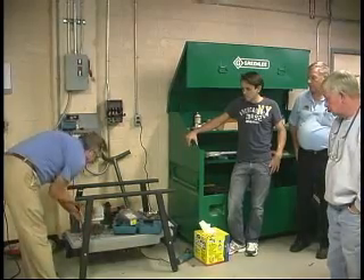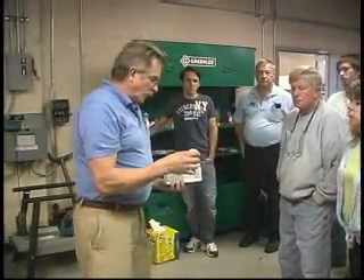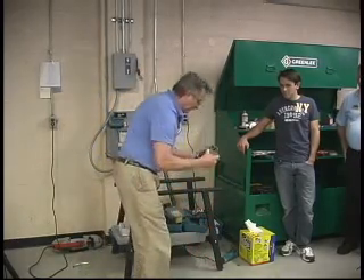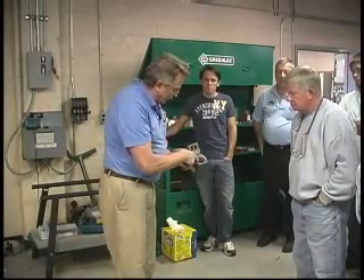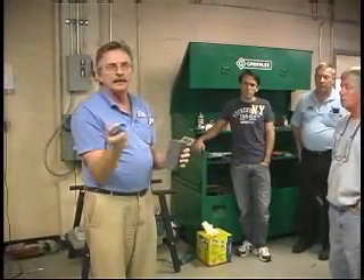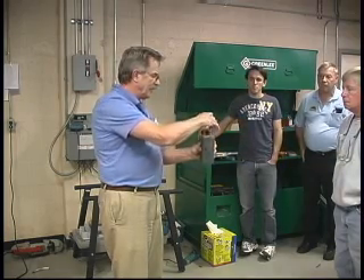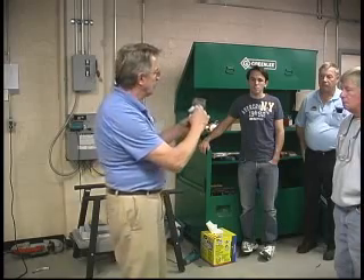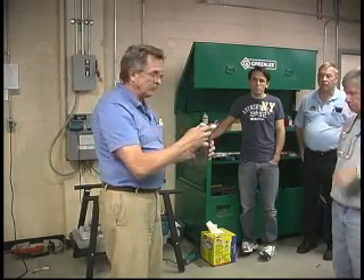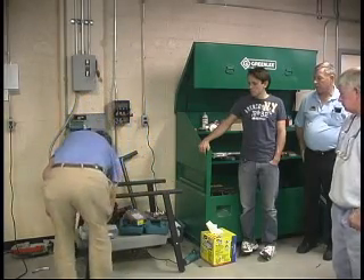Here's what one of the shots looks like — they come in little canisters labeled with a number. When you install this type of shot, there's a little silver disc that you drop into this chamber first, then you pour your shot in after everything is set up. At the very bottom of the canister is the powder that ignites — essentially gunpowder. You tap it out into a little area that extends out, and some older molds have an opening where you shoot the spark right in.